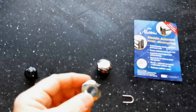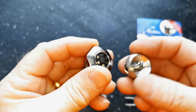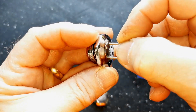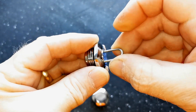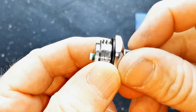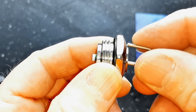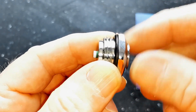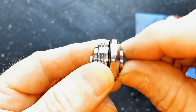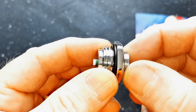Compared to a manual air vent, the auto air vent is very shiny with a nice bright chrome. The U-key allows you to put it into the cartridge so you can open and close the valve and remove the cartridge. When I unscrew it, you can see that little plug goes in and out with a little rubber seal — turning it opens it up, and if you keep going it closes it altogether. You would use this for bleeding and draining your radiators, and also to remove the cartridge completely. As that is a very small hole with a rubber seal, I can see the seal going hard over time and that little hole getting blocked. There's also a little delicate spring on that plunger which could possibly get stuck over time.